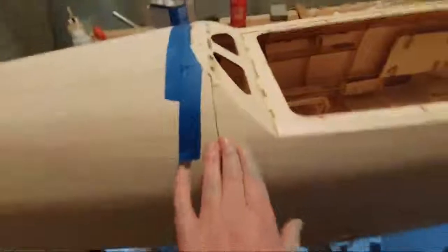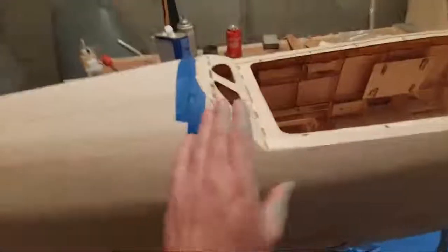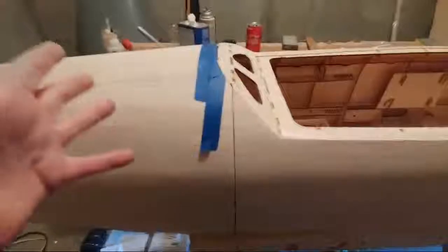Oh, I got dirty. But anyway, I am going to glass the whole outside part where that goes in, and I will primer it and make it nice. And I will come up there and dress all these edges up just a little bit. Now it looks like a really big gap, but it's really not, because you're going to be putting some resin in there and this and that. It's just simple planning. Once you get the resin on here, you're going to have to come back and sand these off, and it's very fast. This stuff sands amazingly quickly, but you want to make sure you're doing these other parts and making them.